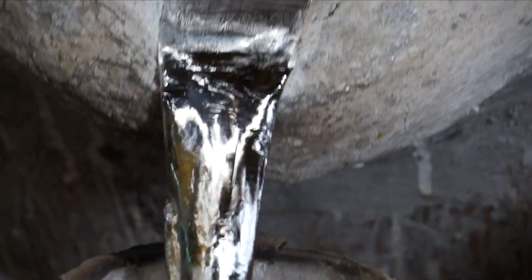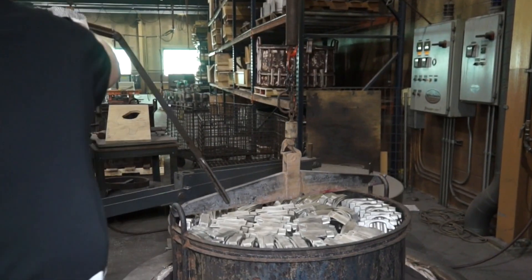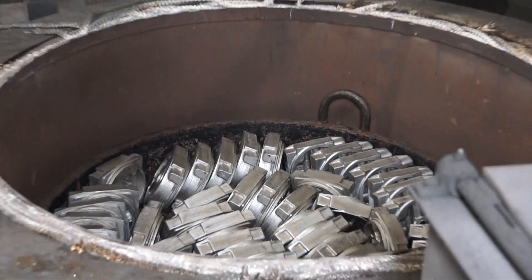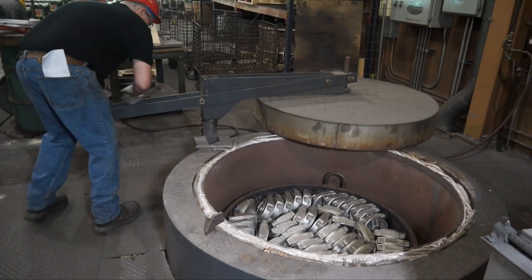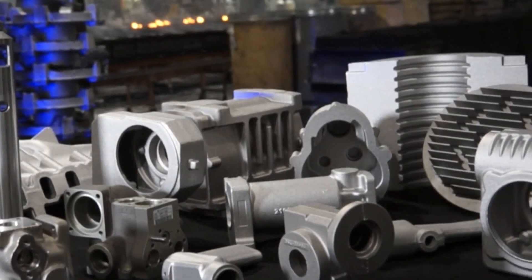To provide the customer with a casting that is machined like it's bar stock. We heat treat all of our own castings in-house, and we've done that for the 26 plus years that I've been here. We do an awful lot of A356 alloy castings with a T6 heat treat on it. The 356 alloy is a majority of what we pour — the bread and butter of the aluminum casting industry. The T6 spec is a wide spec; it runs roughly from 55 Brinell all the way up to 95 Brinell. We typically try and get them a little bit harder than most, staying at the top end of the range.